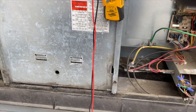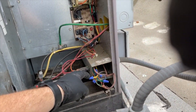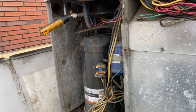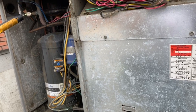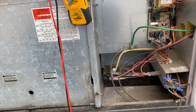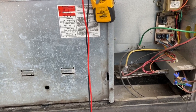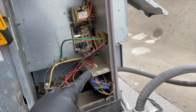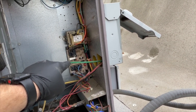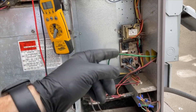This is a single-phase heat pump — the compressor's not coming on and the contactor's not closing. I've already checked and I'm getting the call at the Y wire, so for some reason the contactor isn't energizing. We hooked up a gauge to verify we have pressure, and we do — plenty. We'll also hook up the high side to double-check. Basically, the call for cool goes through the high and low pressure switches, back to the logic board, which then sends voltage to the contactor to close it and turn everything on. The fan is direct — it just turns on when it receives the call.